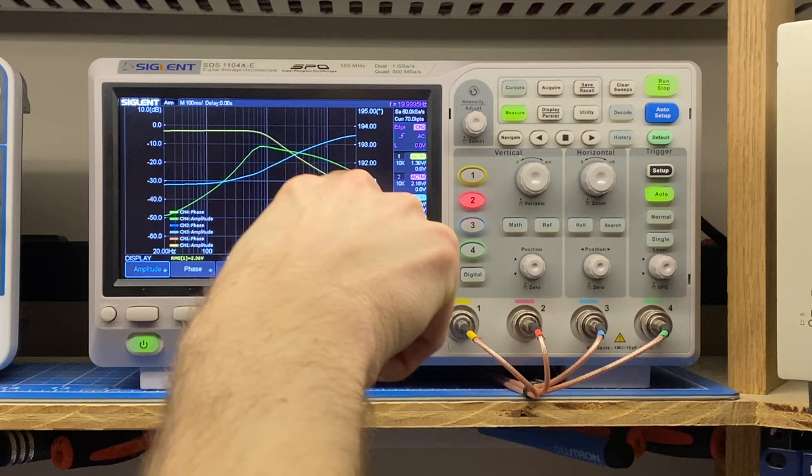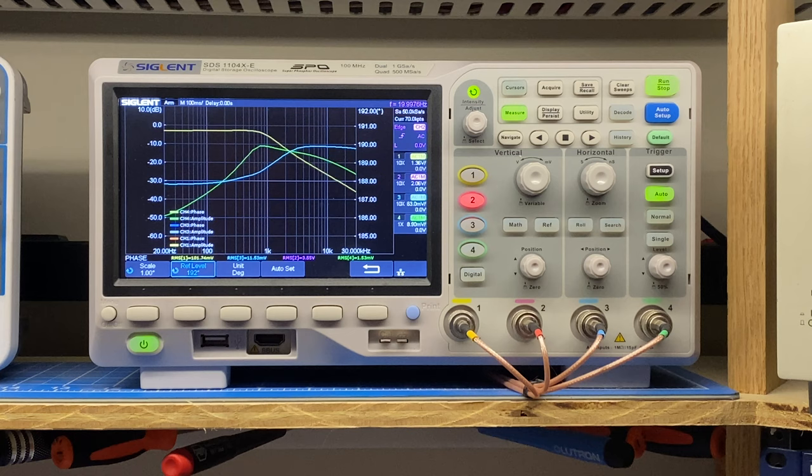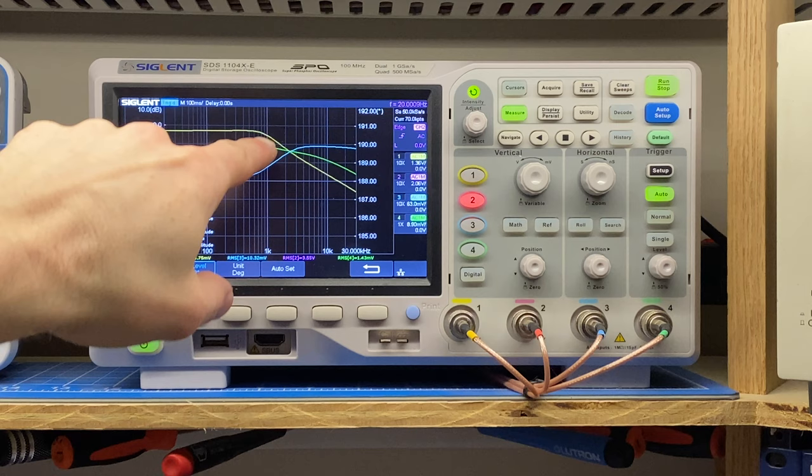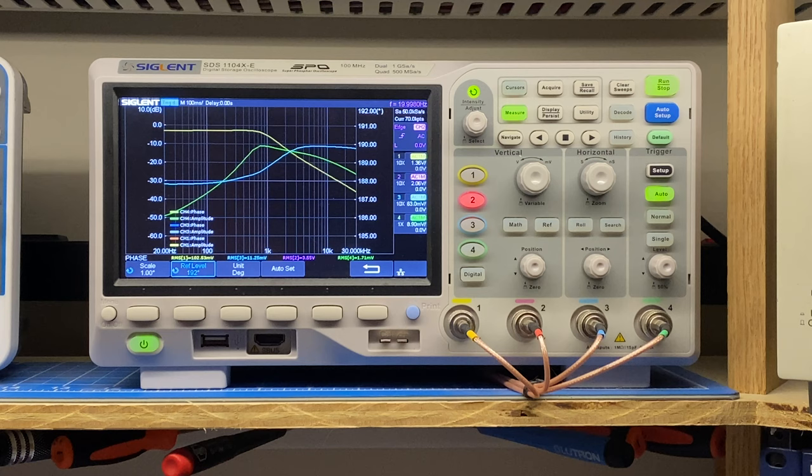All right, this is the final plot. This is with the 2,500 to 7,000 in the high position and the 7,000 and up in the low position. We can see the blue trace has come way down relative to the woofer. And then it's a little bit boosted here to where the blue line is coming over the green line there. So that's how the tone control works on this, or the adjustments on the back. It only affects the tweeter.